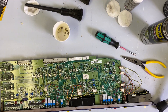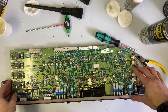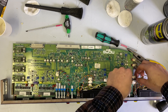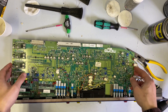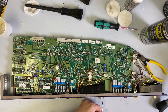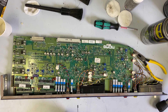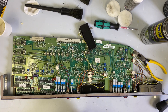Now we're going to loosen up our little keepers, and this module will separate — it'll come right out. When you pull this, you just want to be very careful. There are a lot of little cables that can get caught. Most of these connectors have little dabs of silicone. When I pulled the matrix modules out they didn't have the silicone, but on the aux master modules they do. Now that this top board is separated, I'm going to pull the fader. These are all the same screw so I'm not keeping them terribly separated in my little parts cup.